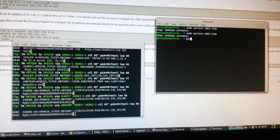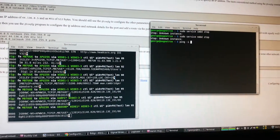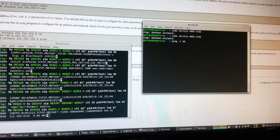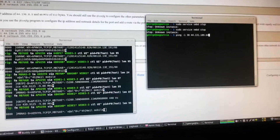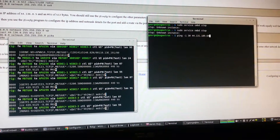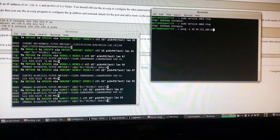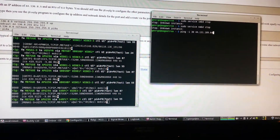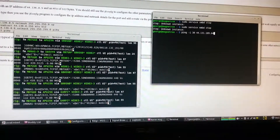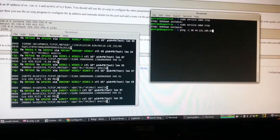Next thing I want to do is just give it a quick test — this doesn't always work and it depends on the network state. So let's set ping with an interval of every 30 seconds and we'll give it my IP address. I have two IP addresses in the 44 block — 44.131.189.64 and 65 are both registered to me. I've got a VX8 monitoring, so hopefully we'll hear the transmission go out.